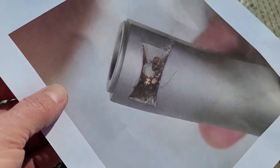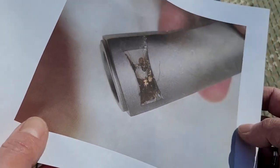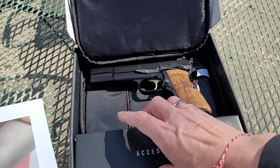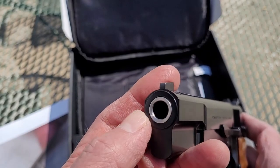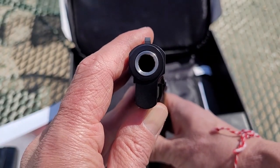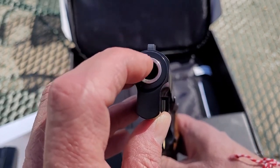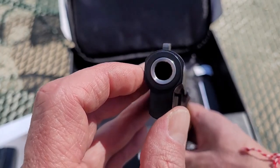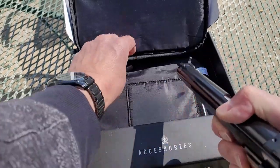What you're looking at here — we're going to do our best to explain it — is the front of the slide. That's the front dovetail in an SA-35. They're all assembled and put together in the same way, and it's a little different than it was done in Belgium at FN Browning and some of the other high-power clone makers. In the front of the high-power slide, you have a barrel bushing. I call that barrel bushing the eighth wonder of the world. This is a BH Advanced 11-degree crown Elite Expert barrel — you're going to see how snug and nice that just fits all the way around there. That's the way you want a barrel to fit in a high-power slide bushing.